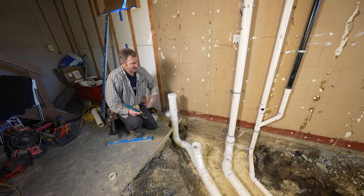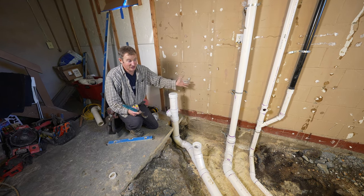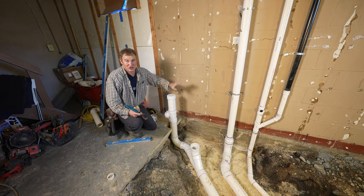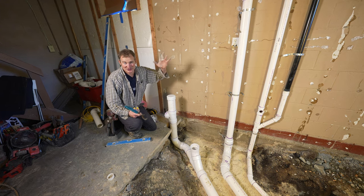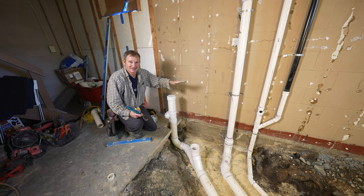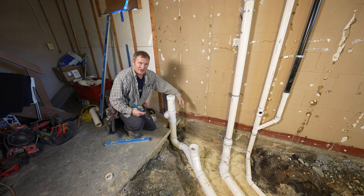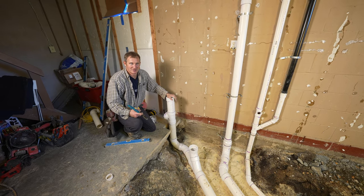So very simple, straightforward. And if you were able to just find a floor drain, find your big stack, you could do all of this without having to tie in and redo your upstairs bathroom. It just happened to be that we wanted to reconfigure that anyways. It was already going bad going into the connection, so replacing all the plumbing made a lot of sense.